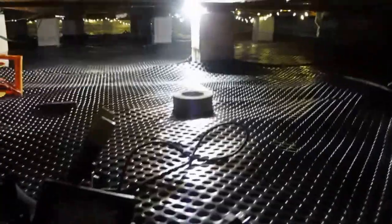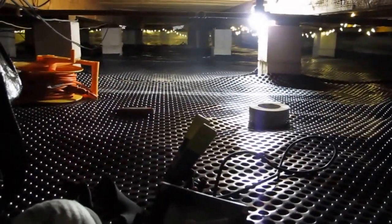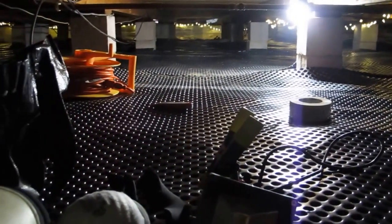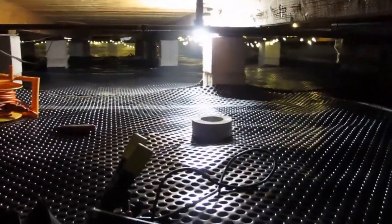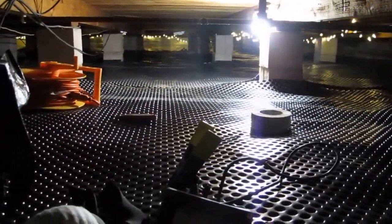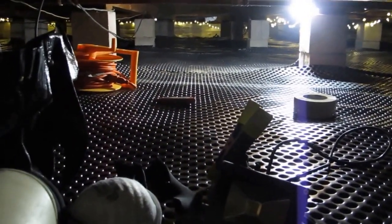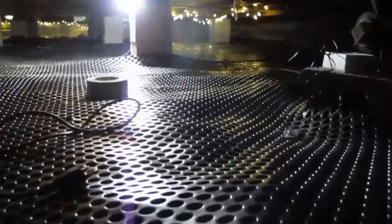And once you lay it down on the dirt, it does a couple of things. It completely removes the dirt floating around in the air. It makes the crawl space so much nicer a place to work in, and functionally it prevents any rocks from penetrating the final plastic you're going to put in.